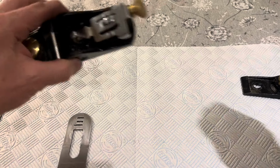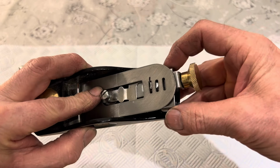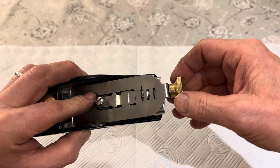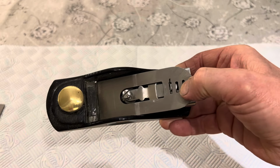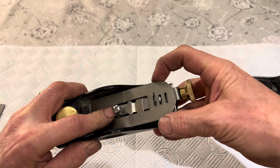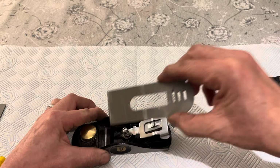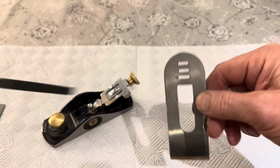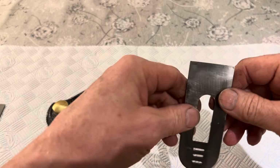It's because when the blade was in, and you did your lateral adjustment there, there wasn't enough slot in the blade to move around the depth adjustment. That small nib that you can see in there was fouling, so when you did that adjustment, it actually rode over the top of that and made the blade act a bit peculiar. So if you happen to have a reasonable blade, which the one I have is reasonable, then you can just realign that slot slightly, and that'll straighten the adjuster up. Also, when you've done that, a square blade will square up on it without any problem.